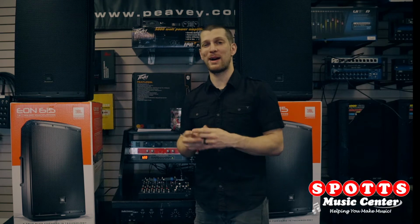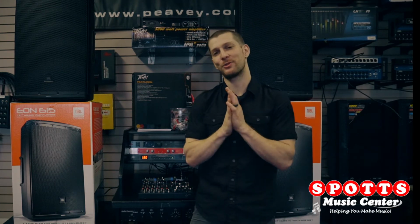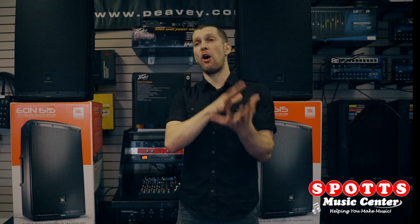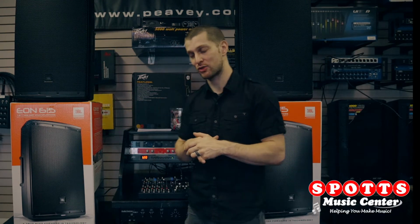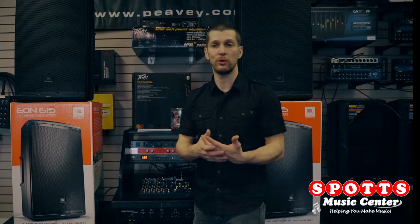Today I want to talk about powering on and off your system. We want to make sure that we're doing that in the proper order so that we don't damage our speakers. If we're powering the system on or off incorrectly, it can send a pop through the system, through the speakers, and that can damage the speakers, especially over time. So, I also want to talk about a piece of product that can help you with this.